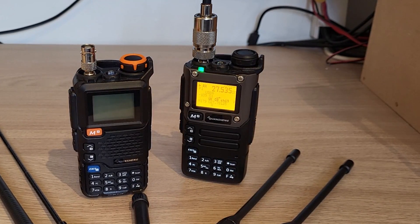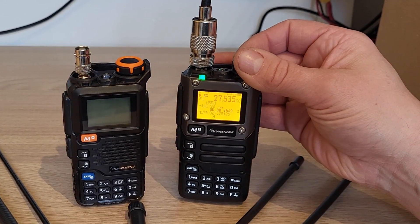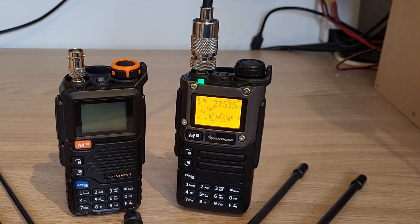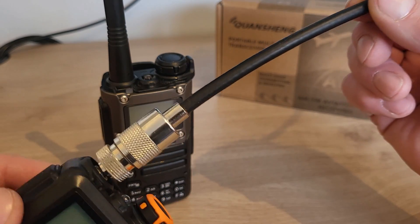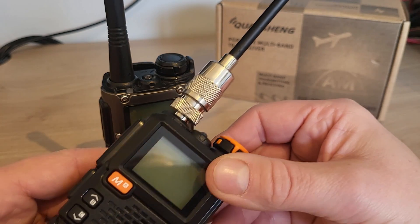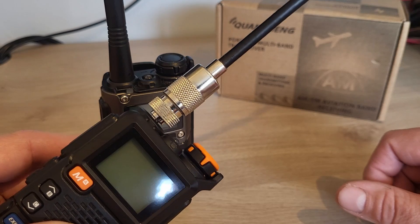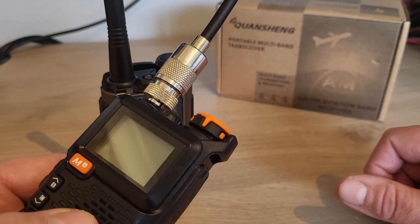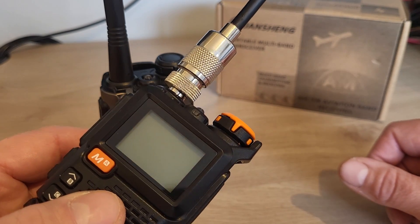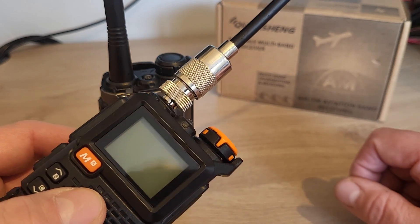If I'm at home and I want to listen — and if you saw that first little clip at the beginning of the video on 27 MHz — I was plugged into my end-fed long wire with the PL259, fed with some RG Mini 8 coax. It's an end-fed long wire about 66 feet long at the end of the garden in an inverted L configuration: it goes up about 20 feet and then the rest is horizontal back towards the house. That works really well on the HF bands, and just by coincidence it's actually resonant on 27 MHz, so it does work really well for 27 MHz, 11m and 10m reception.